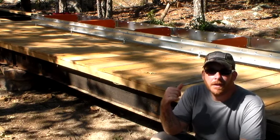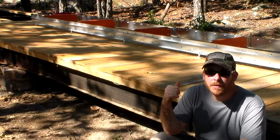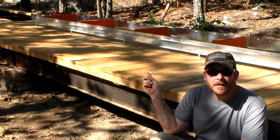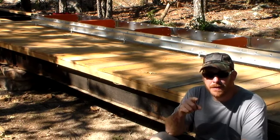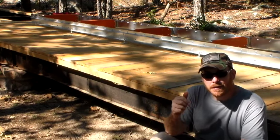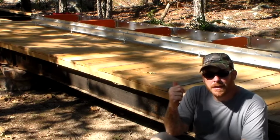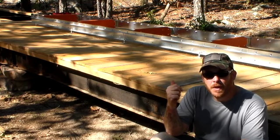Okay, so I've got my feet on, and we're going to adjust these out with some levels crosswise, because once we tighten the bed assembly up, it is going to be level lengthwise. And it should stay that way if you tightened it up correctly. So we're going to take some levels and take these adjustable feet and level it out real quick. And then we're going to go over to the shop and get into the boxes and get some more parts out that are relevant for our next few steps and bring them over and go ahead and put them on.